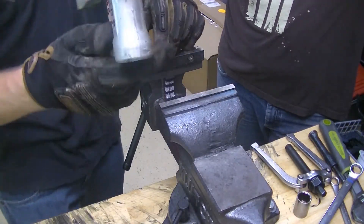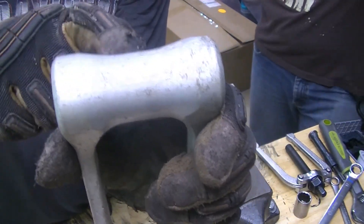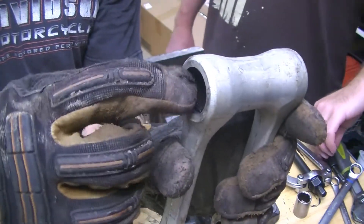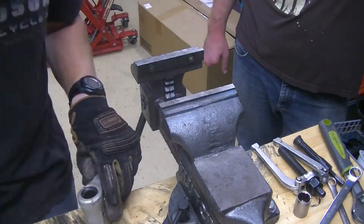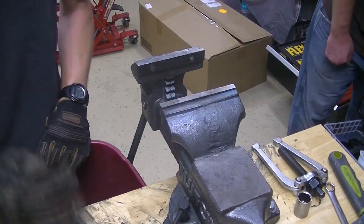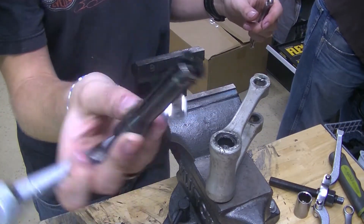The procedure is going to be different for this piece because it slims down really hard in the middle — it's wider here than in the middle, so we can't use the push-through technique. We have to use the pull-out technique. The easiest way to make this work is to get out all the needles on the inside so you can grab this edge right here with your puller. This is our bearing puller — we got it off Amazon. It's got a bunch of these little legs on it.